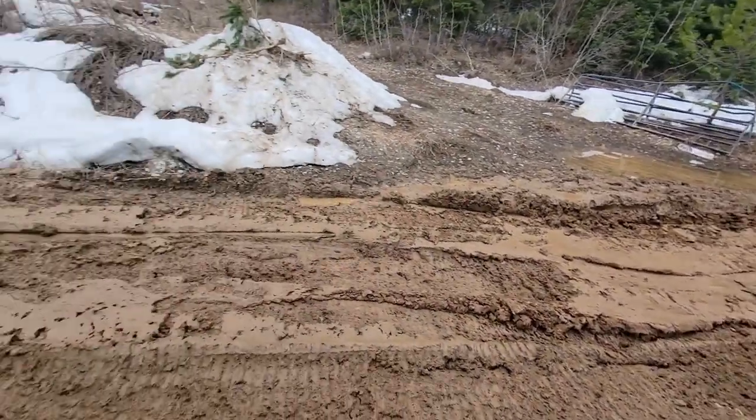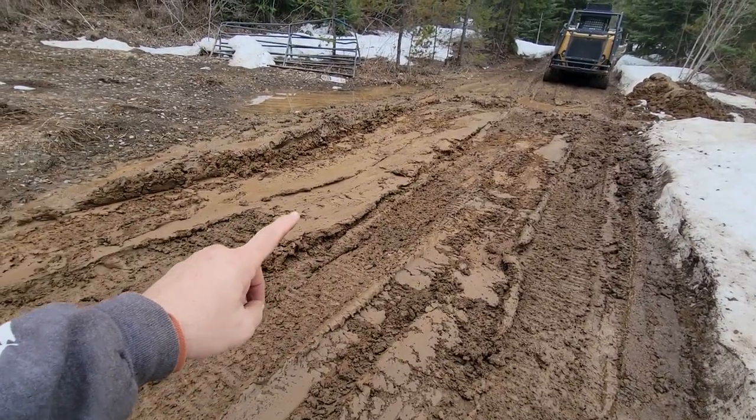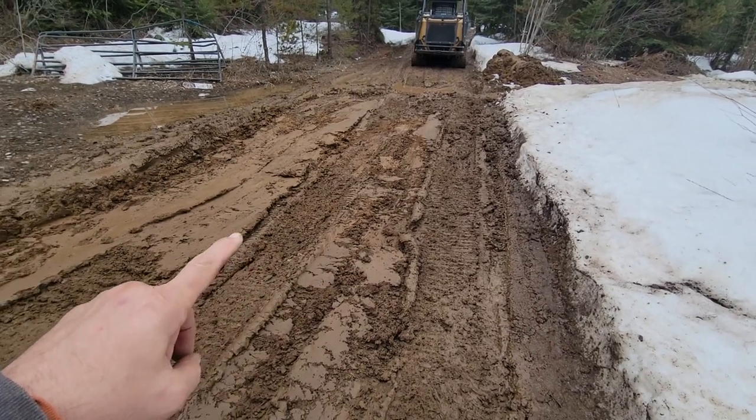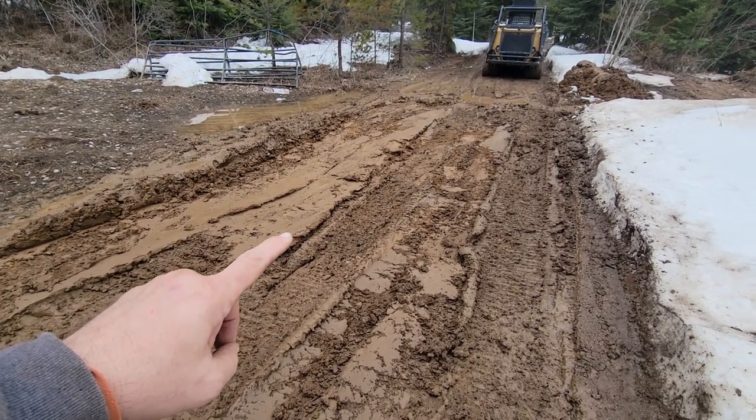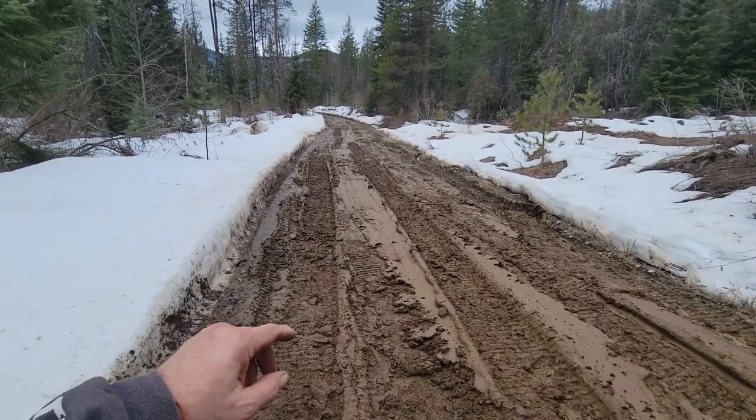This is the reality of our road. As soon as this dries out I'll be grading all this, smoothing it all out, getting it level, and then we're going to have to put roadbed fabric on here. I researched the heck out of this — how to repair your road, roadbed fabric necessary or not — and it was split about 50/50. Some guys were saying just put some good heavy base down and top it with three-quarter or smaller rock. The other 50% said no, in situations like this it's absolutely necessary to have roadbed fabric, because the rock sinks down or the mud comes up. Right here there is no rock at all — it is just pure clay and mud, so there's nothing to support any kind of road base. If I put a bunch of rock on this it'll last for a year, but it's going to start pushing down into the clay, the fines come up, and the rock disappears.